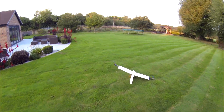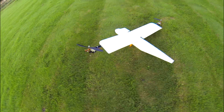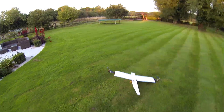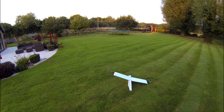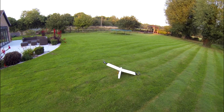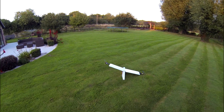Right, so I've got some temporary motors on — just smaller ones. Hopefully with the lighter weight they should be fine. I should order some better quality motors because these Turnigy ones are a bit rubbish. The wires are always really brittle and they just snap — that's what happened: one wire snapped and it just jitters. So let's try these smaller motors and see if it will fly.